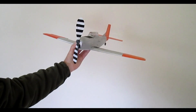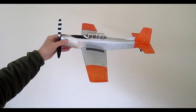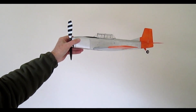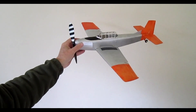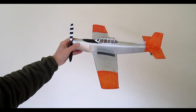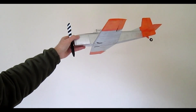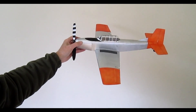The other thing I was keen to incorporate was a very high center of gravity. Those two things in combination — the high center of gravity and the very low dihedral — mean that the ailerons have to do a job. If I built a demonstration model with five degrees of dihedral per wing, it wouldn't be demonstrating anything useful at all.